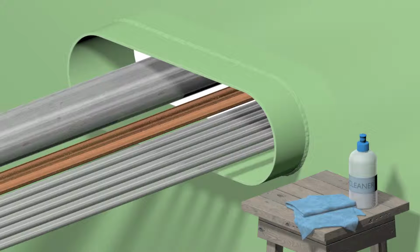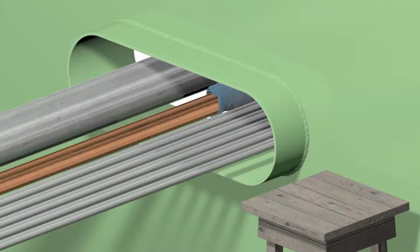Clean the inside of the transit frame thoroughly and remove any dirt, oil, grease, and other residues or corrosion from the inside. Clean and dry the pipes in a similar way. Any moisture, dirt, or oil residues will have a negative impact on the adhesive properties of the NOFIRNO sealant to be applied after filling the transit frame.